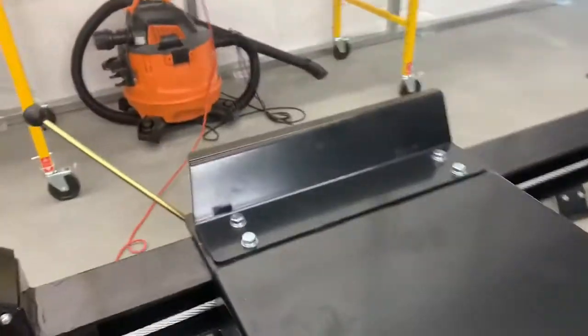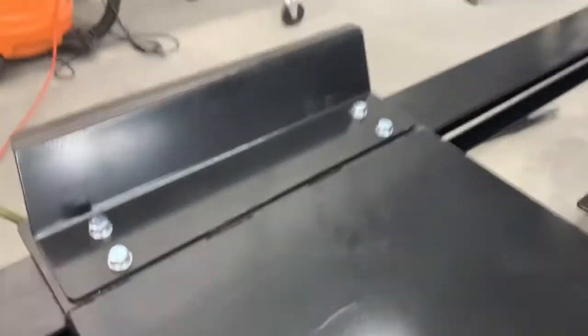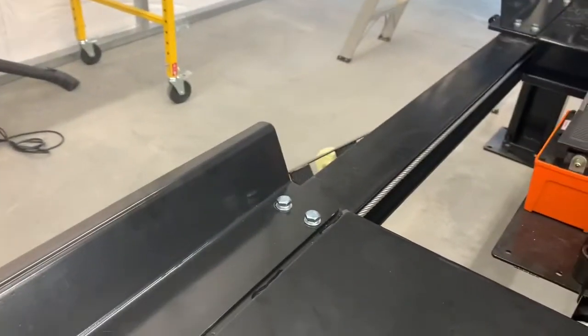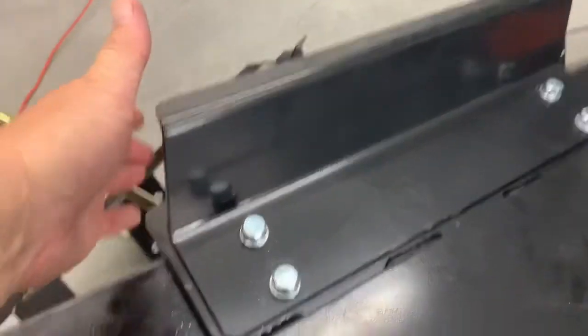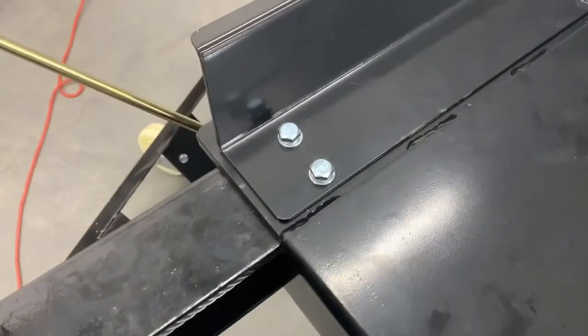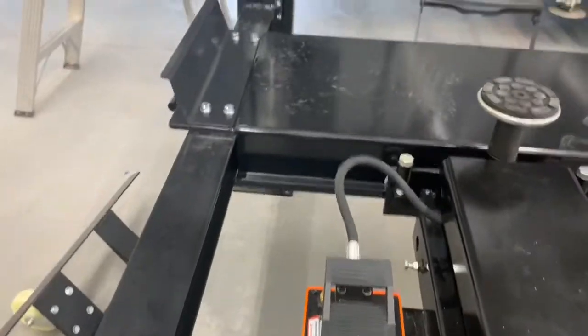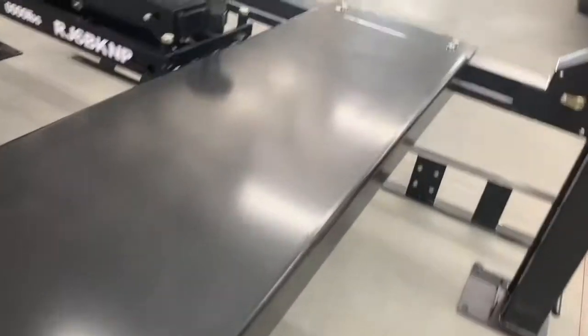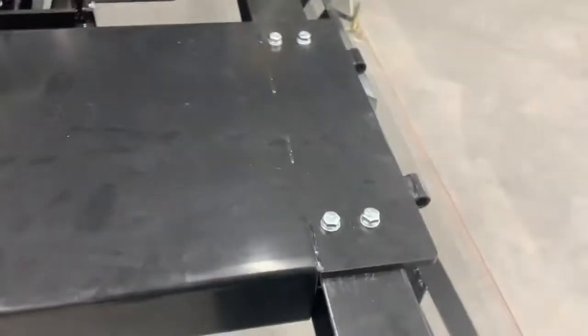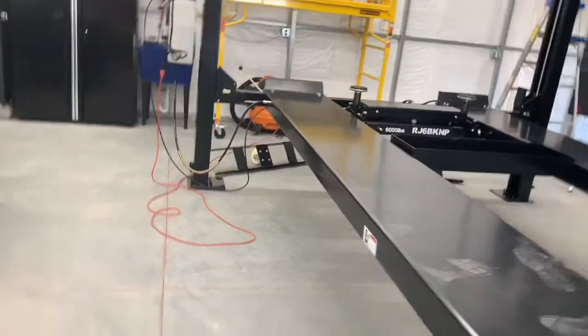For the wheel stops: this is an extra plate mounted on top of the ramp. When you're looking for the bolts, the four bolts for the two stops here are the long bolts, because of that extra plate. Whereas in the rear there's no plate, so those are the shorter bolts. Shorter in the back, longer in the front.